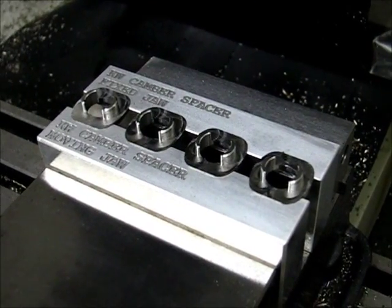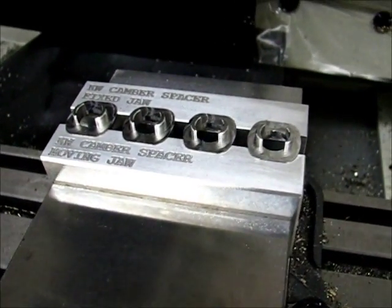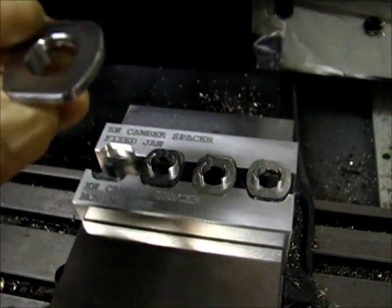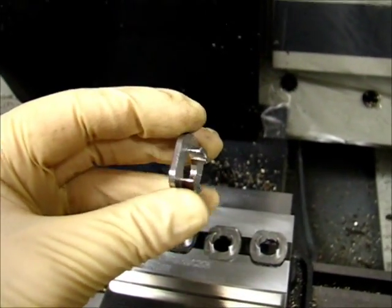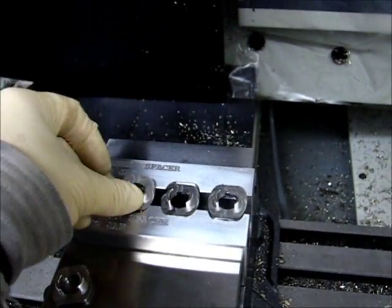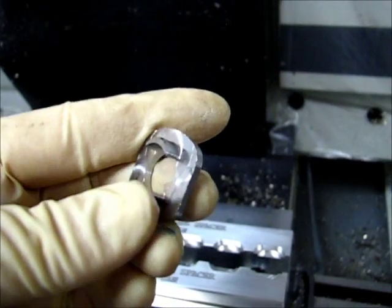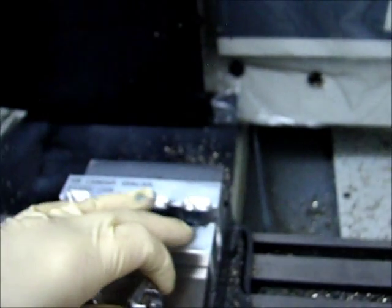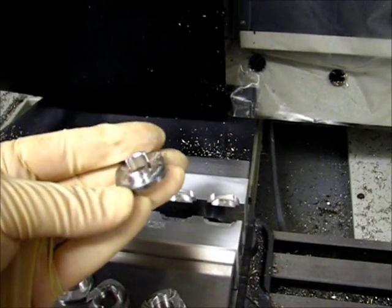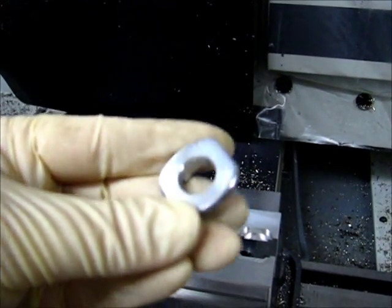The tool survived. All the crud has been cleaned off the vise, so you can see the parts by themselves. I'm ready to take the parts out and see how they look. They're thin, of course, but they look good so far. There's a burr on the edge, which isn't surprising — I can't chamfer it because it's sitting a little bit less than twenty-five thousandths above this surface, so it's really pretty tight there. But there's a chamfer on the inside — that worked out perfectly. I'm very pleased with that. Not too big, not too small.